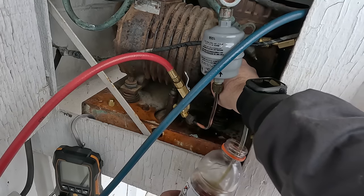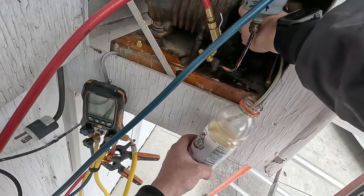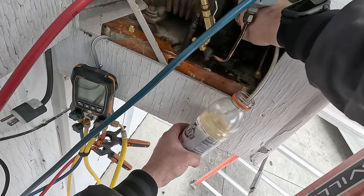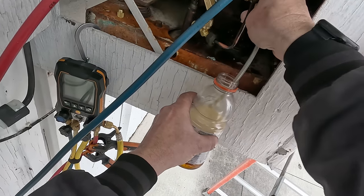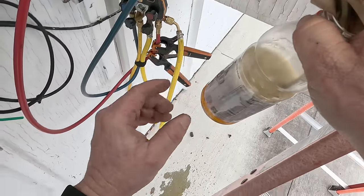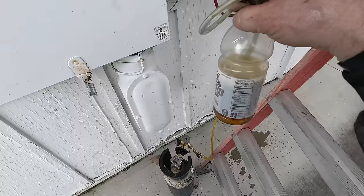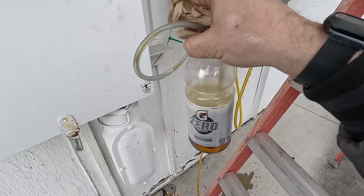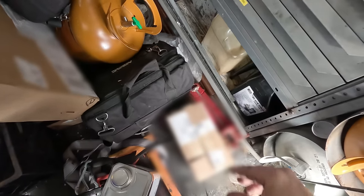It shoves it right out of the compressor. That's the easiest way to change oil in one of these. Obviously a normal compressor wouldn't be easy to get a hose down in there, but we're just using the nitrogen to purge the oil out. I'll end up switching this to PoE oil and we're gonna put some 134A in it. This compressor is old enough that — I told him — if the compressor takes a crap, it was time for a new system anyway. So I'll measure in the same amount of oil that I took out, maybe just a little extra since I spilled some on the concrete. I carry at least three gallons of oil — when you're doing grocery stores, you need it.